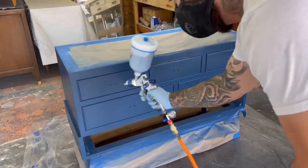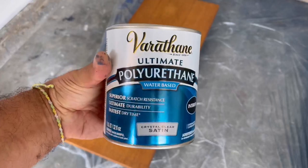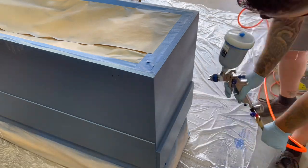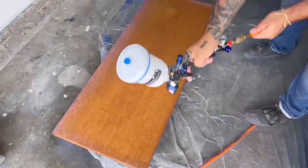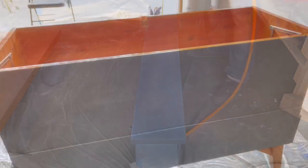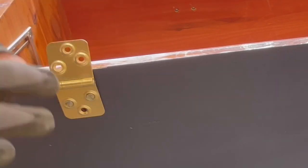Here is where I'm painting the mixture of black and blue paint, and it does look a lot darker. Definitely it looks a lot better. I use water-based polyurethane as my top coat with a very nice satin finish. My paint does have a satin finish built into it, so if anybody can tell me whether it makes a difference to use a paint with a finish in it, or if I should just use flat paint since I am using a top coat, let me know. After about three coats of clear with light sanding of 400 grit between each coat, I reinstall the freshly painted hardware as well as the top of the chest.